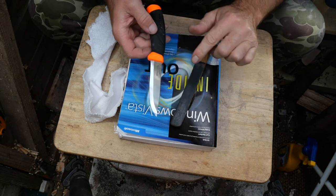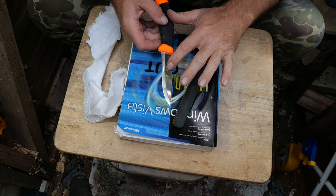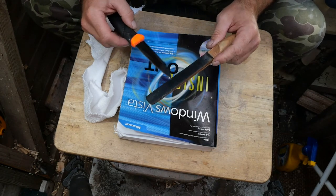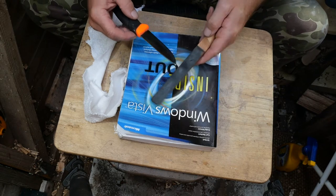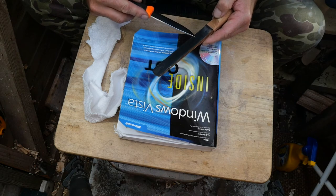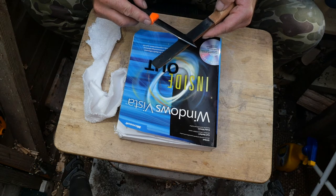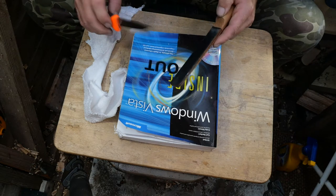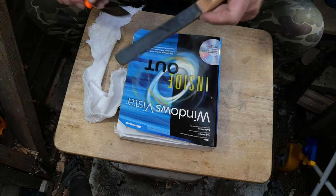I've sharpened this Scandi now. Everything I've done so far has been flat on the bevel — I did the Bester 2000 stone, then a 6000 Bester polishing stone, and then a bit on the 8000 — and I've stropped this flat. I haven't actually gone off the bevel at all. But now I'm going to do what I normally do, just to make sure the edge is right, so I'm going to lift off the bevel. You can see there are no marks there. I don't use a soft strop, so you really have to do this just to be sure you've definitely taken out all the serrations.